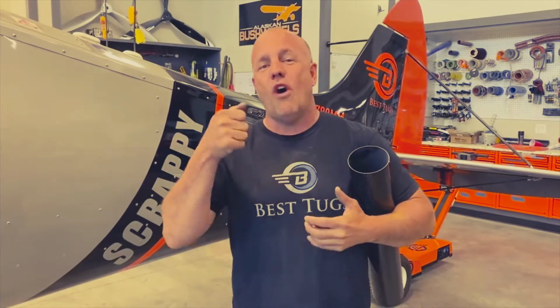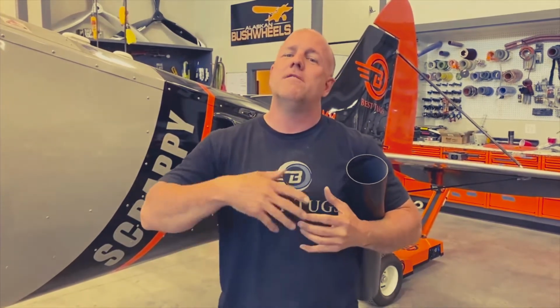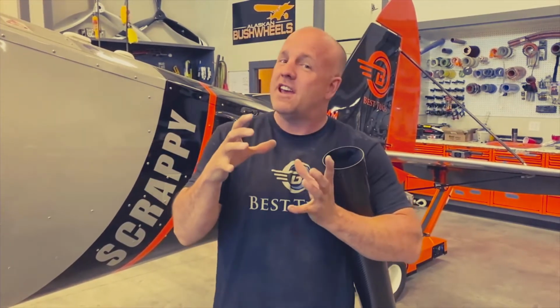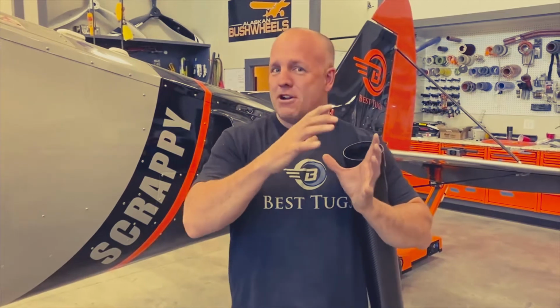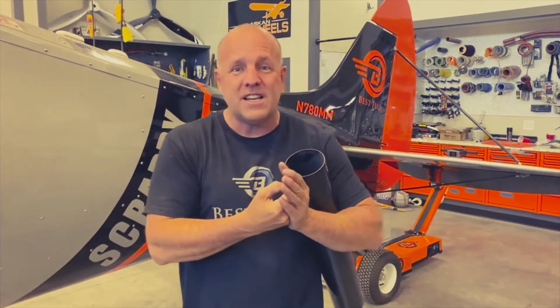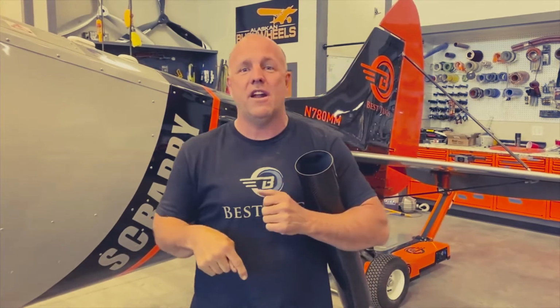But as an added backup for safety, if I was washing the plane or if I went into extra heavy rain, I go a little bit beyond. Then I always put a drain in the bottom trap that I created inside the intake of the filter, and there is a drain and it drains out the bottom of the plane. And since it's on the upper deck, high pressure side of the filter, if water does go in there in flight, I have air-created pressure pushing and it just will spit the water back out at high velocities.